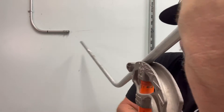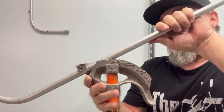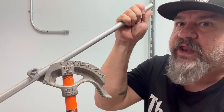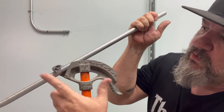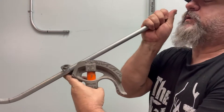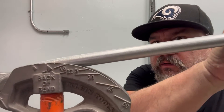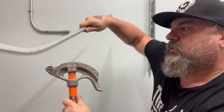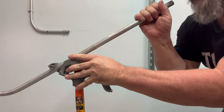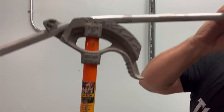The most important thing to do is make sure it's not dogged. Line it up center — look down the center part of it. We do our second mark; the front of the bender points towards the center. We're going to bend this down to our 22-and-a-half degree. Then we're going to do the same thing with the other side — the front of it towards the work, towards the center. Line it up, look down it, make sure that it's centered so there's no dog leg in it. Same thing — 22 and a half.